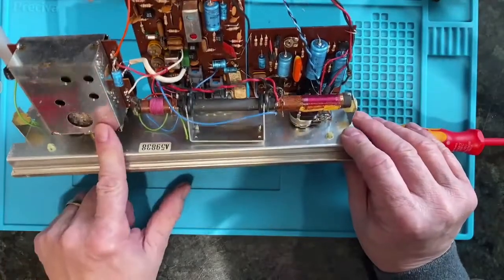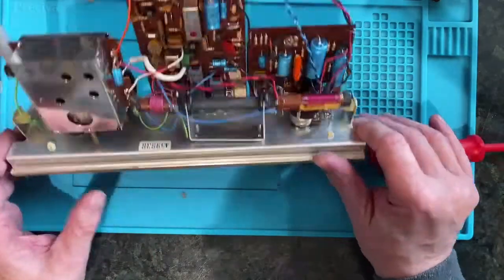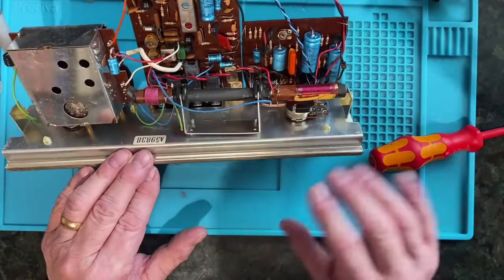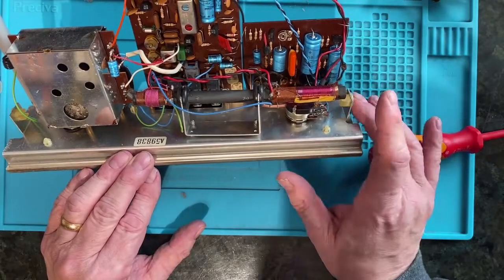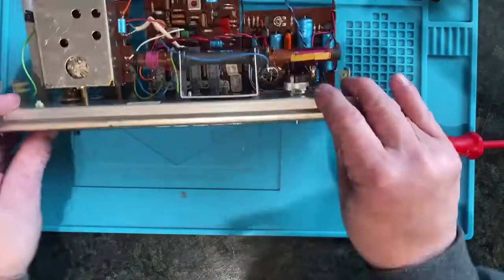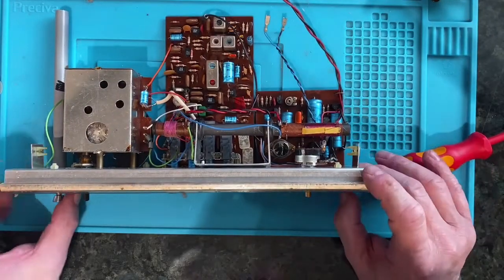Like a lot of the Hackers, you've got your FM RF module here, your AM stuff, and your audio amplifier. As it sounds good I'm not going to go around just changing caps - I don't see the point. I know a lot of people say you should always change them, but it sounds okay. I do notice it's got these old lock-fit transistors which have been known to give problems in the past, but I'm not going to interfere with things that work. I have plenty of problems interfering with things that don't work and trying to make them work.